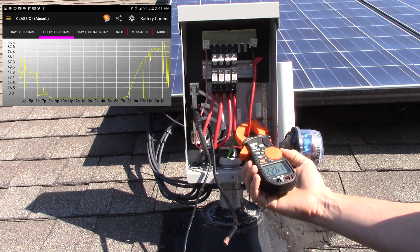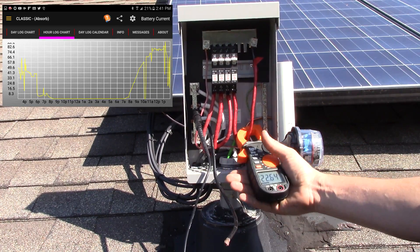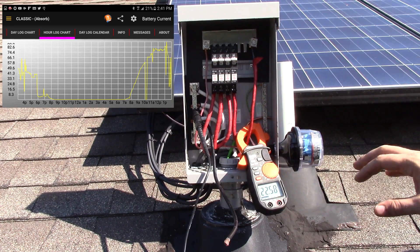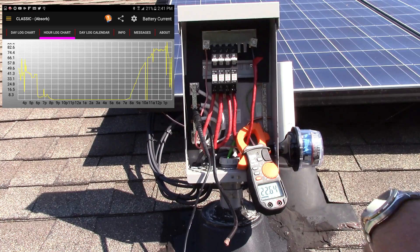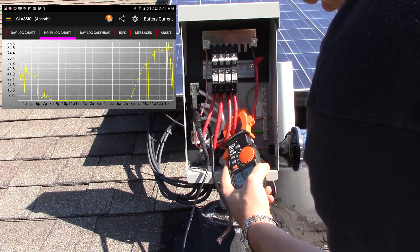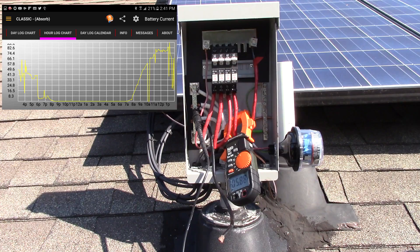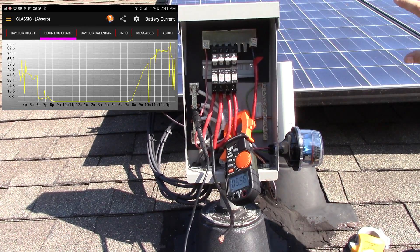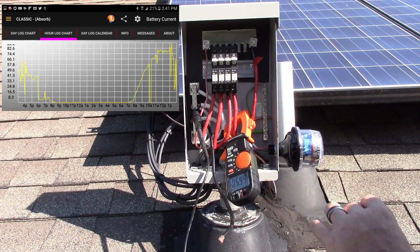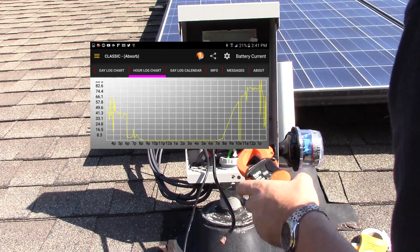Let's try to figure out what's going on. I checked the amperage on all of these panels. Looking at that one right there, we're trying to resolve our problem — it's probably going up because the sun's getting brighter. We did do a short circuit test and we're at six amps. These panels at solar noon should do about eight point three or eight point seven amps — I'll look into that and let you know in the next part. Right now we're doing five point nine four amps at 10:30.